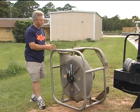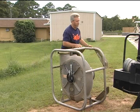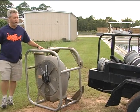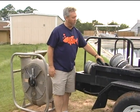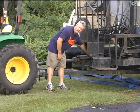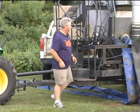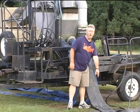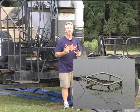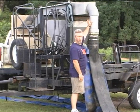We're going to physically concentrate the animals down and pump them through this fish pump. The animals are going to come in the bottom, come out here, and then we're going to connect some large hosing that goes up to our dewatering station. Right back here we have the pump that moves the hydraulic fluid, and that hydraulic fluid goes through a series of lines down to our fish pump, which is currently in our pond. That's going to drive the pump to move water up through these black hoses up into this dewatering station.